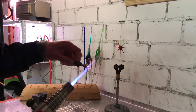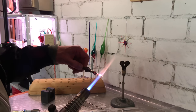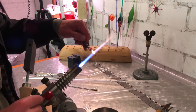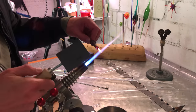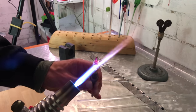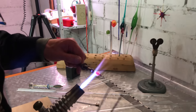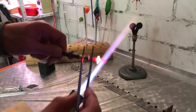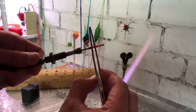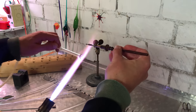Since it was the hardest part, we decided to first fuse the electrodes into the glass. For this, a glass tube was again slid over the tungsten electrode and melted. To get a good surface for fusing it to the glass tube, additional glass was applied and formed into a disc. This prepared tungsten electrode was then fused into a glass tube.